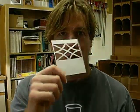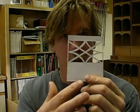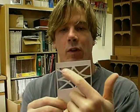What's up everybody? I just want to give you a little breakdown on the pattern of the fretwork that goes across the top again. This is essentially what it wants to look like. I showed you earlier how to transfer all this information onto your piece of wood. After you get this whole thing drawn out on the piece of stock, I just took the Bosch Colt and removed all this material. You could use a Dremel, a carving chisel, almost anything you want. I just happen to have a Colt — my Dremel broke on the blanket chest, so I ended up buying a Colt. I buy stuff as I need it.